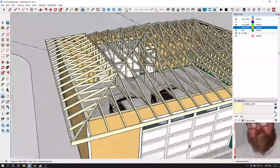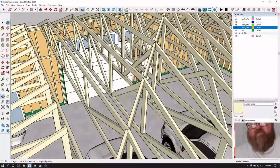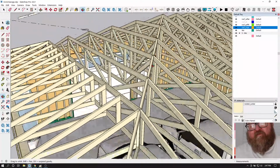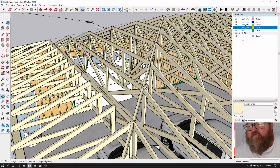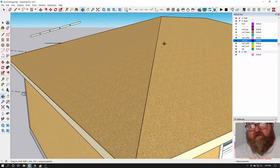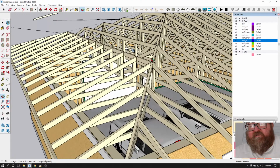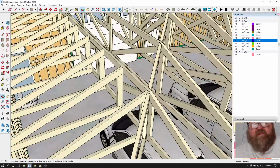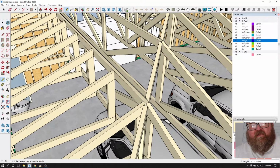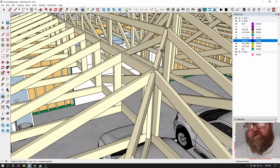But one thing I have seen done on hip trusses is put blocking, especially if you're going to have a metal roof. Put blocking to connect the hips, so you'll have something besides just decking. When we used to do this, there's your OSB, right? But between the trusses, which is about a 26, how many inches is that? Pretty good little span. If you just went from here to there, oh yeah, that's 33 inches. Excuse me. And what happens is the decking will tend to flop sometimes between that long span.